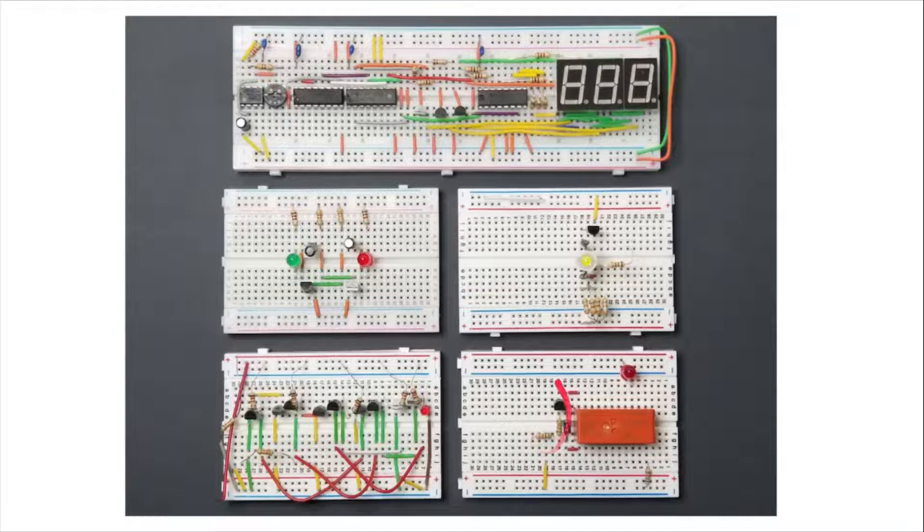There are a few examples of breadboards here that have been put together based on schematics — from a fairly simple transistor switch relay driver, to a D flip-flop made from transistors, an astable multivibrator, and a multiplexed LED display demo. In summary, breadboards are easy and intuitive to use. Once you know how they're laid out, you can easily build your prototypes based on schematic diagrams, from very simple circuits up to very complicated circuits and systems.